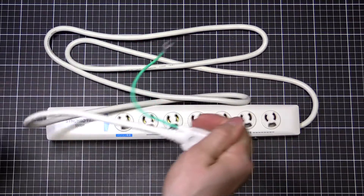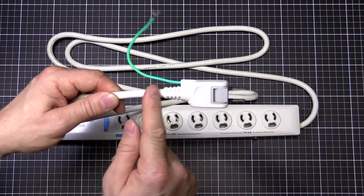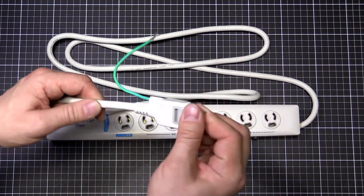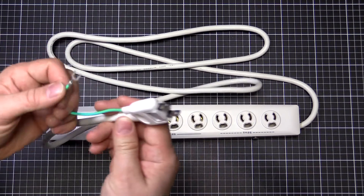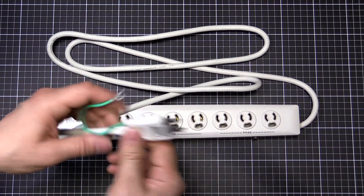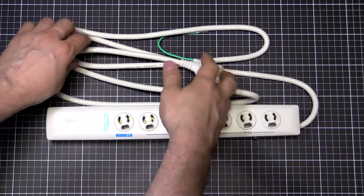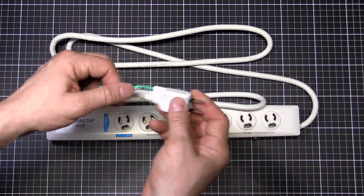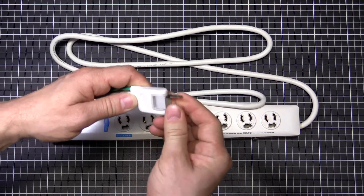People just can't be bothered - they plug it in, it works. I might change this to a three pin plug. They do use three pin plugs in Japan, not very often. But in my house, which I'm building, I've specified every point is to be earthed. In Japan, with the earthing requirements, it's only recommended that all points be earthed. The only ones they routinely have an earth at is the kitchen, the bathroom, and the laundry.